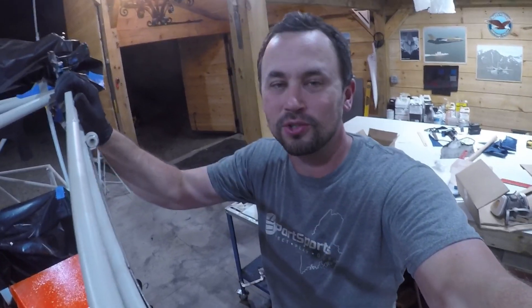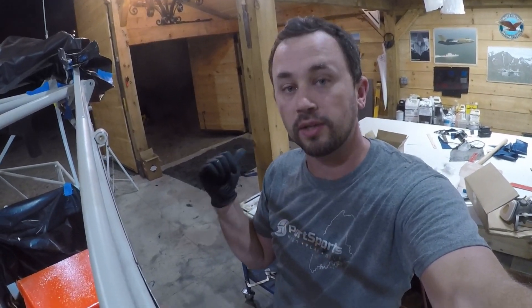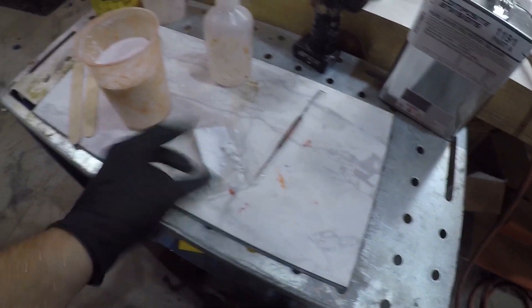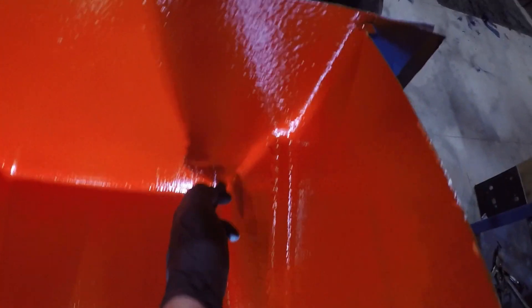Already I've got some mistakes, as is the case with composite work. What I got are these little voids and bubbles in two of the corners. Something always seems to go wrong. That is going to be a repair from the outside of the mold, which is a pain, but I'm going to try to fill it from this side. I've got my marine gel coat, my catalyst, and some silica, so I'm going to mix a small amount and smear it into the little holes.